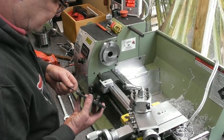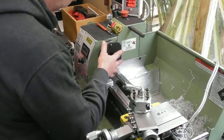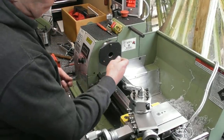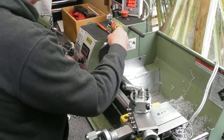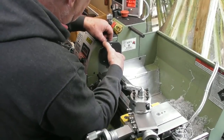I've just borrowed three studs out of my face plate. Obviously I don't want to put nuts on the front edge — those proper coach bolts would be a lot better. So I'll fasten that up now and then we can machine the OD.